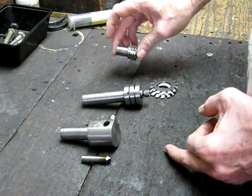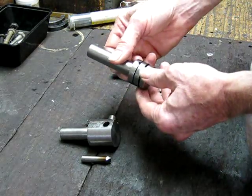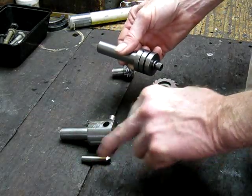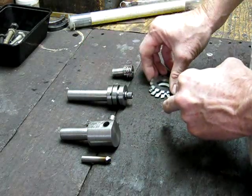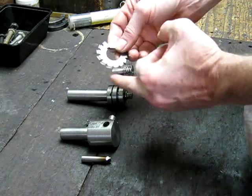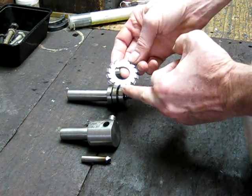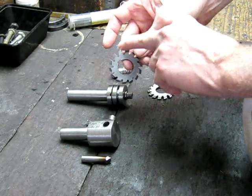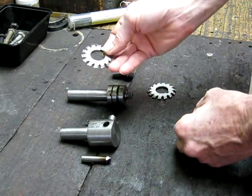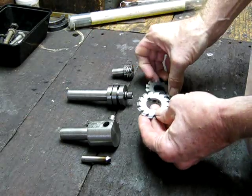That's my least favorite option, so I'd basically steer clear of that myself. The third option — and your best option in my opinion — once you've got a bit of experience and tried your fly cutter, is involute gear cutters. These are cheap to buy and extremely good. They have multiple cutting teeth, which puts the least amount of stress, vibration, and load on a lathe. They cut faster and more quietly. You can buy them off the internet for about ten dollars plus postage from Hong Kong or China — high speed steel, excellent quality.